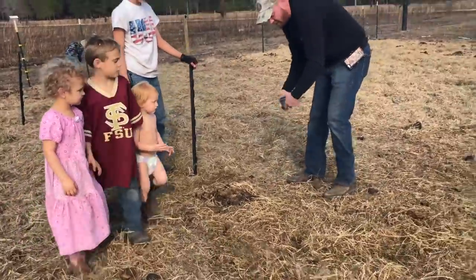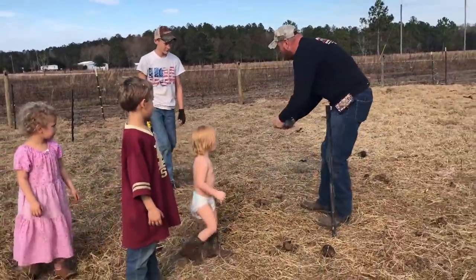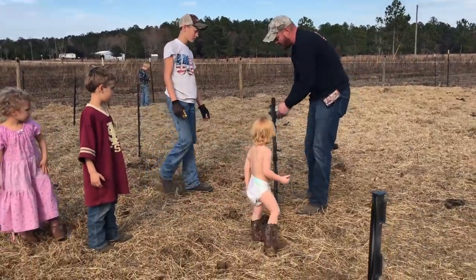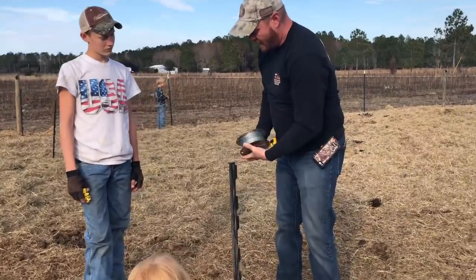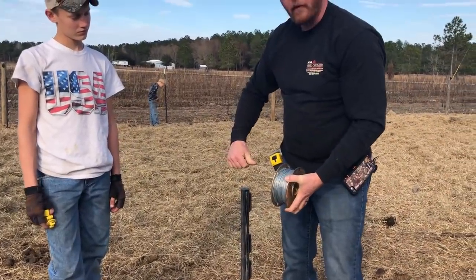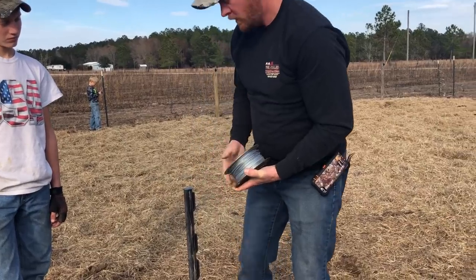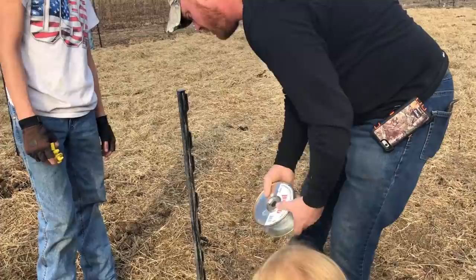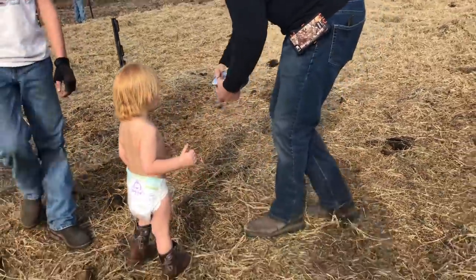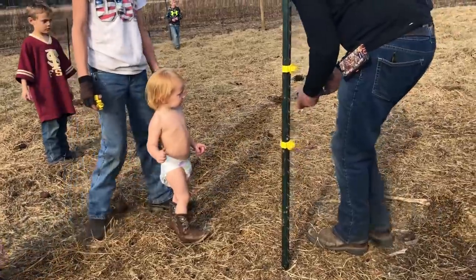If I were running a lot of this, I would want a screwdriver to unspool this off of. That's another tip. If you're running wire like this, it's a bad idea to roll it off like that, because then you have lots of twists in it and it'll twist up and break. It'll get a kink. But if you just unroll it, it pretty much eliminates twists because it's coming off of the spool the same way it was put on the spool.